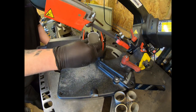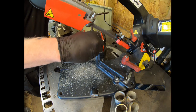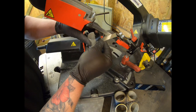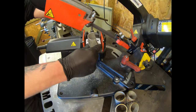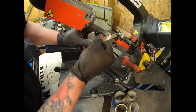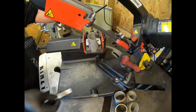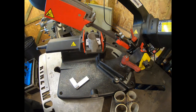The same as before, we had cut it there, and we're going to rotate this now to round about there, but we'll check it with our little set square, sorry. Try and get that as perfect as we can there. Let's try and tighten it there. Just double check. Yep, happy with that. Tighten the jig back up again. And we'll go ahead and make a second cut on this piece.